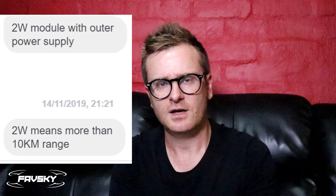Some people are having issues with the October and December OpenTX update on the Nirvana with Crossfire, and I understand that's the same issue many people are having with other transmitters. The solution is to roll back the Crossfire firmware to something like 2.9, then work forward until you find the latest version that actually works — and it will work, a lot of people are doing it.